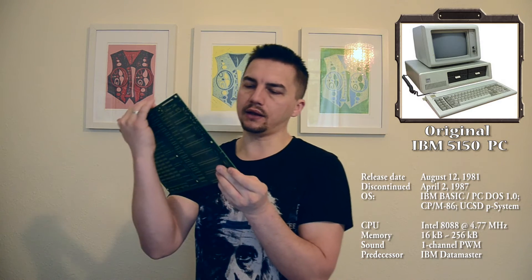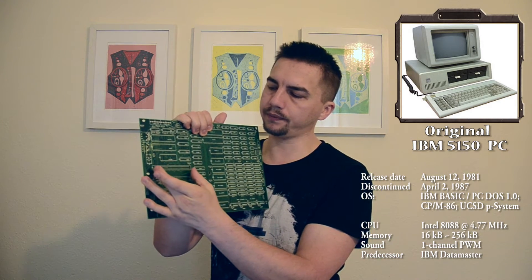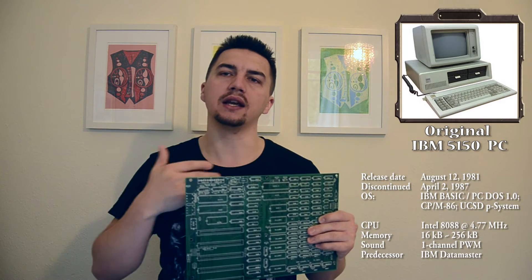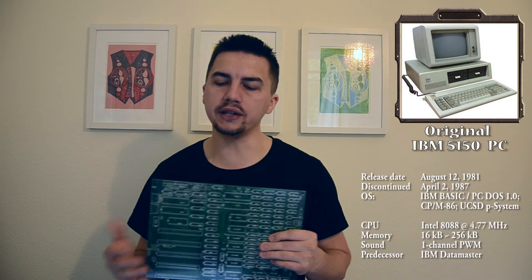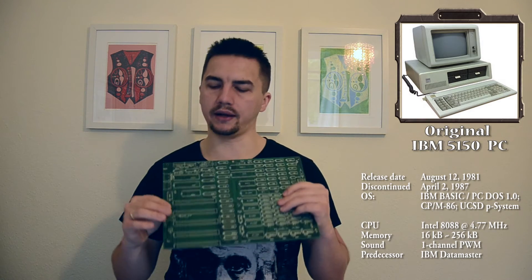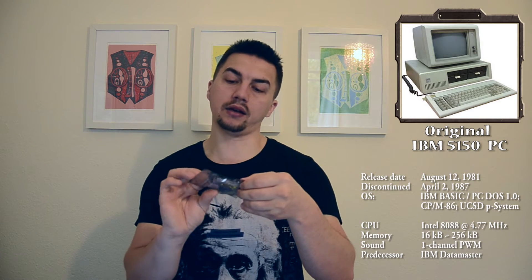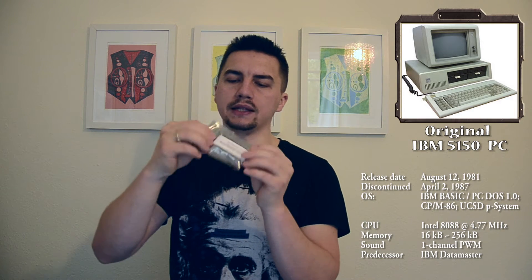As you can see on the motherboard, these are the ports where expansion cards go in — I might have those in the bag too. Basically, the chips make the motherboard work, but they don't make it talk to anything outside itself. So in order to have video, audio, a printer, or other peripherals, it needs expansion cards plugged into these ports. In the little bag we have a little speaker — I probably won't be using it because I hate PC speakers — but the original IBM came with one, so this clone has one too. Next is the memory bank.